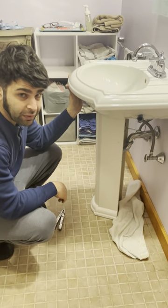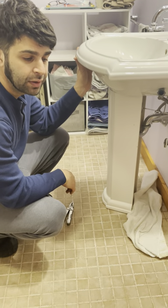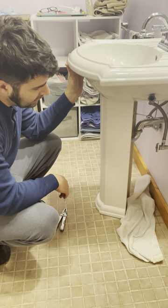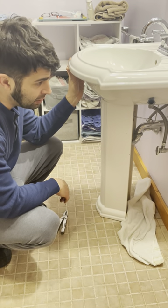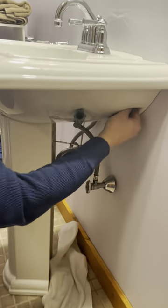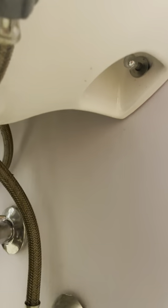My wife caught me in the middle of the process because we're going to go back and pick up this vanity — it's used but a nice one and the guy's going to sell it. So this sink bolts to the wall, and that's what I'm in the process of right now — undoing these acorn nuts. Let's see that brass acorn nut here — yep, backed up.